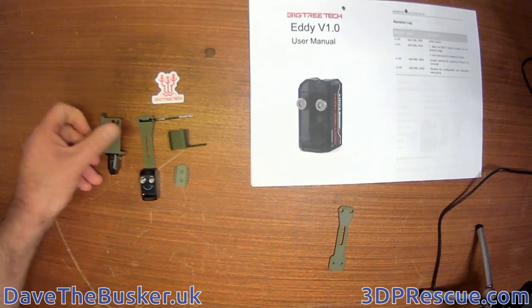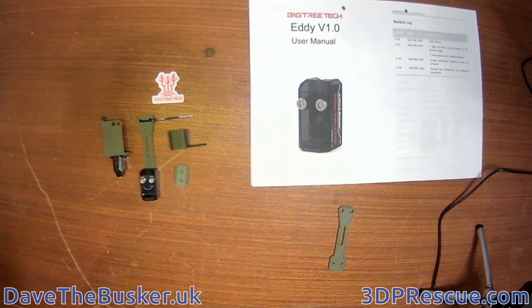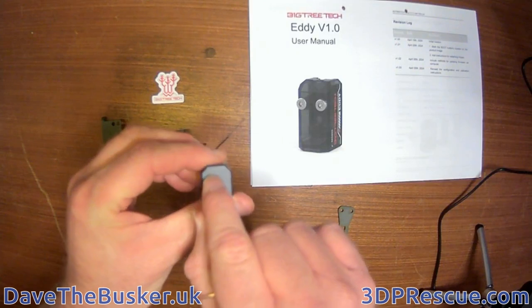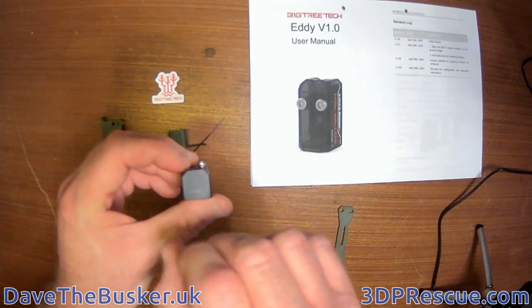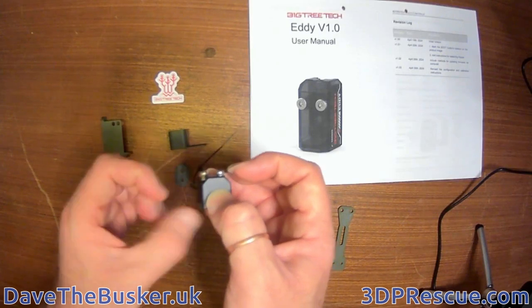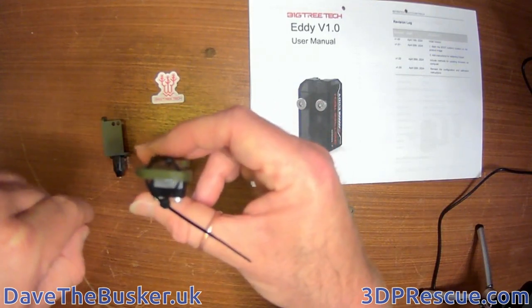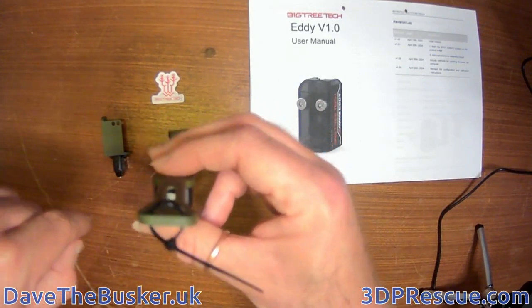I love these probes but eddy is now my new favorite, as long as you've got a steel sheet - most of my printers have sprung textured PEI steel sheets. That's the mounts for the eddy probe. I don't know if this will fit the other version, the eddy coil, as I don't have one, but I would assume so if it's the same form factor. Also, Bigtree Tech have just released an updated manual that shows where you should align in terms of the center - like you would to a pin on a normal ABL probe - so you can better work out where this is in relation to your nozzle. If you've got the older version of the manual, just download the new one.